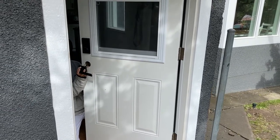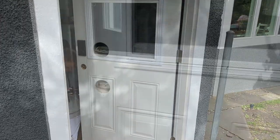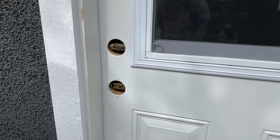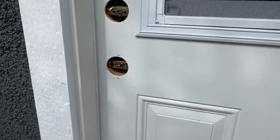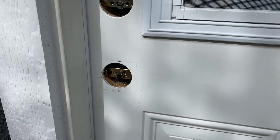It's easier to just remove the hardware and then put it back on. Whoever takes them off should put them back on because it's a lot easier to remember how they work. If the door ever closes without the doorknob on, you need to reattach one side of the doorknob or use a screwdriver to turn the mechanism so the door will reopen.